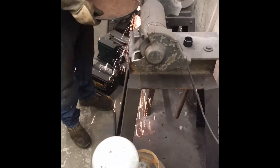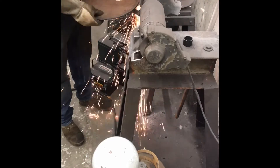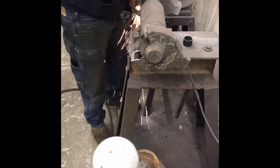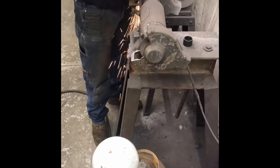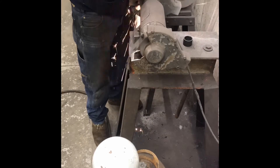The camera angle was really crappy here. I was just going through cleaning up all my burrs after I chipped off all the slag, trying to get the edges nice and clean. I wanted this piece to be as flat as possible so that everything bolted down in a nice way.